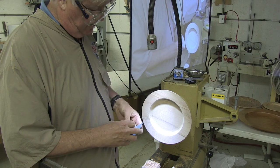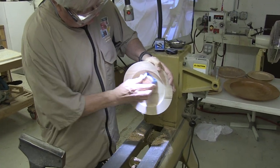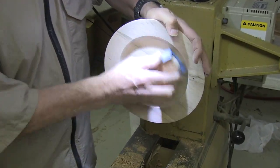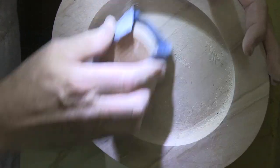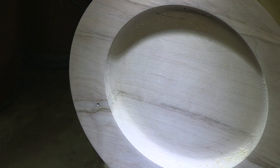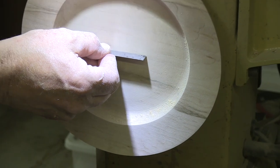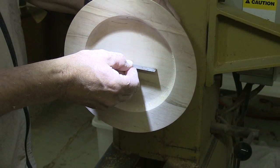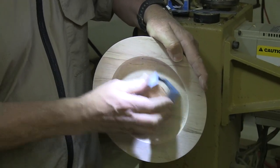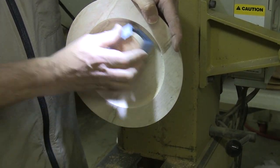No reason to get stingy with your sandpaper when you're working up a sweat, right? So the sharp stuff works the best, whether it's sandpaper or the turning tool. I think the best idea is to use the sharp stuff. That's flat, and it's dangerously close to being flat in the middle, but it's not quite. So a little more work of the same sort, and you'd be flat all the way across, even before you go to the power sanding exercise.